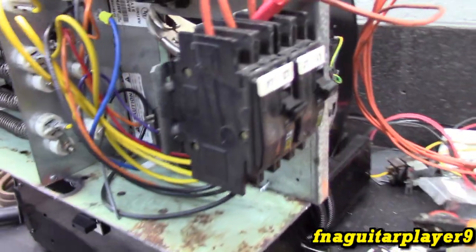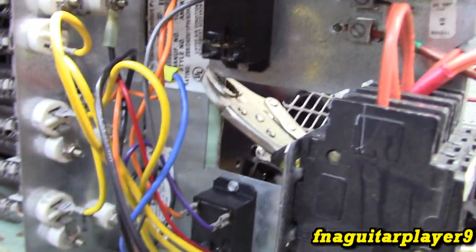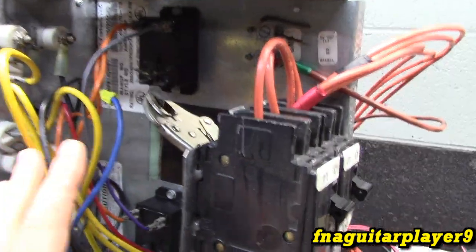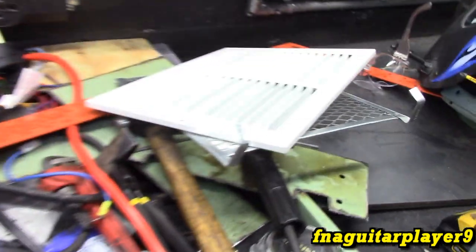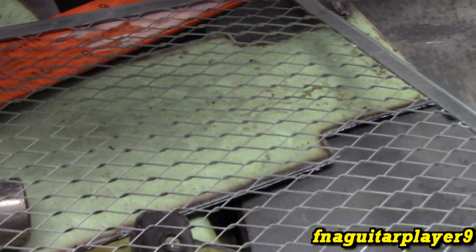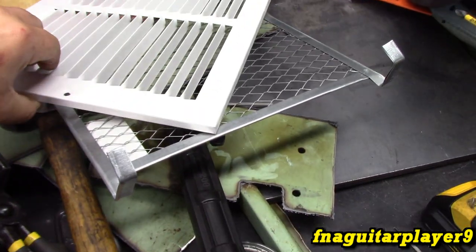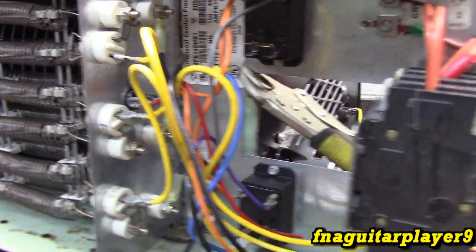Alright, so now all that's left is to mount the receptacle in the back for the blower to plug in. Mount the other relay. And I got to build the bent part here that will cover up the wiring and be cut out for the breakers. And we'll get this vent here to put on the front. That was my other idea, a thing for a roller in a bucket of paint. It's a little bit big, but it'll be fine. Then take everything apart and paint it.